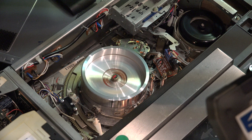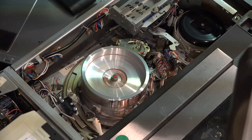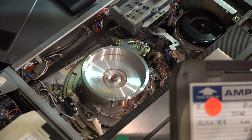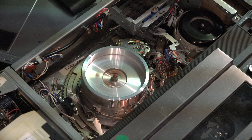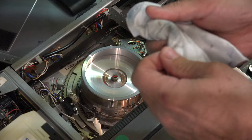The tape has to be fairly smooth. When produced, they had a smooth coating, but with Ampex tapes, moisture got into them — add some heat and more moisture — and you ended up with a sticky surface. It was called sticky shed syndrome because it shed particles onto the head. There are about eight capstans in here plus the head wrap, so there are many friction points where the tape can shed oxidation particles.